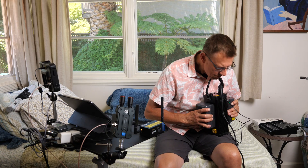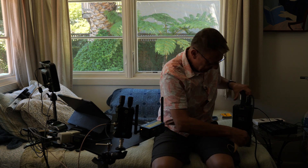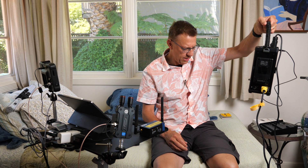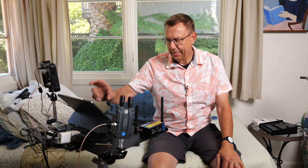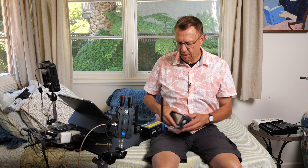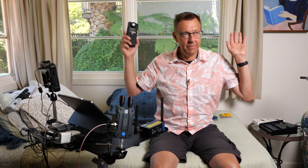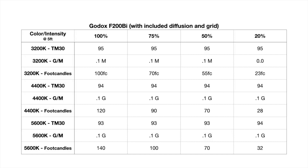Pulling both batteries off simultaneously and restoring AC power brings it back — nice. I have this controlled with Blackout. I don't have a proper profile for it yet, so I'm using a different profile, and it's working fine except that the color position in Blackout doesn't match my meter. To get 5600K out of this unit on my meter, I'm setting it to 4750 in Blackout.